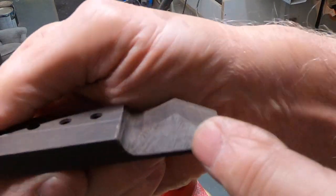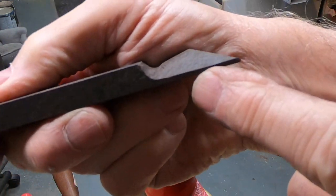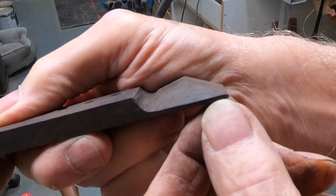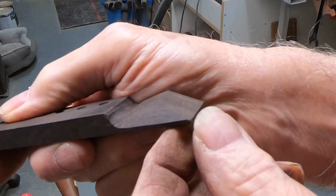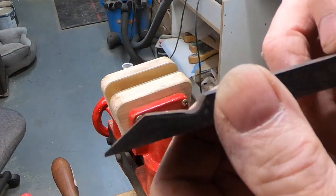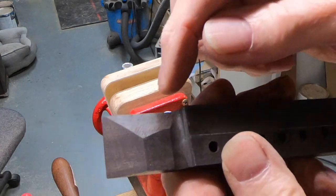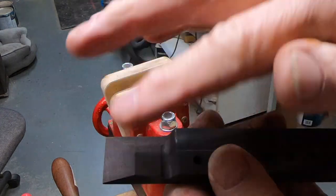And then I came on and rounded this over into this area. I have this lip here — I'm going to leave that because it needs to be a little thinner, but I've got to leave some room for sanding. Then I just need to bring this edge over as well for the pyramid, so I'll roll it down with the rat tail and then bevel that off.